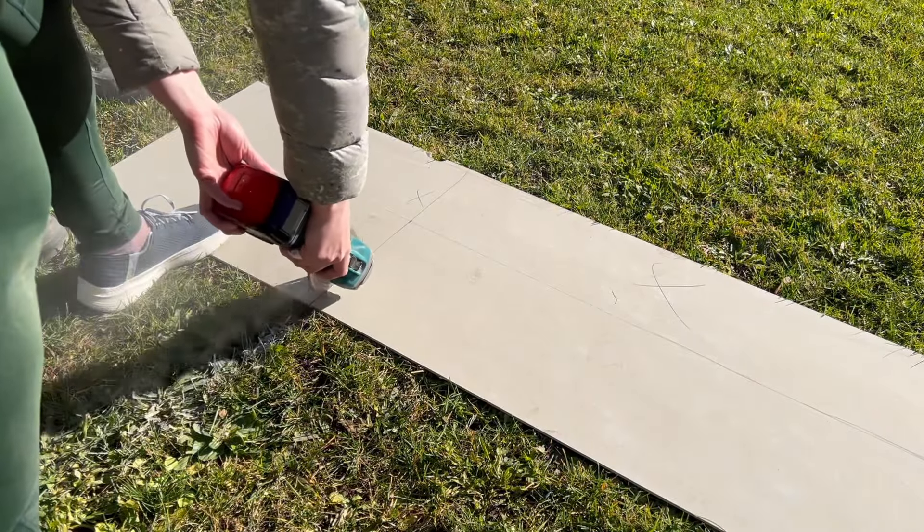Next up I needed to prep for the waterproofing, so I got out my waterproofing tape and applied it to all of the joins and seams to make sure there were no gaps. This includes the corners and anywhere there's a join in the cement sheeting where water could potentially get through, and also around all of the plumbing — I used the fittings as a guide to mark the holes I needed to cut into the waterproofing tape. Once all the tape was ready I then needed to apply the waterproofing primer — a clear coat that goes on everywhere over the walls before you apply the waterproofer.